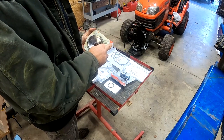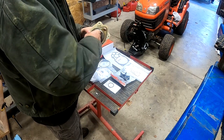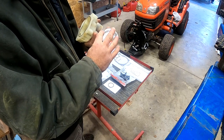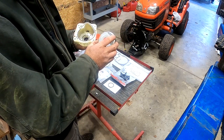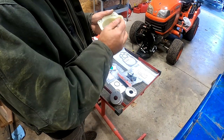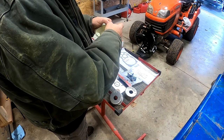I'm going to start disassembling this housing. It's going to be pretty tight in there because when they assemble it they use RTV sealing — they smear a little bit around this side. We'll save this so we know exactly where to put it on the next one. Here I'm using a dental pick to remove all the old O-rings. For this main O-ring, when you dig it out there's going to be some residue in the groove that you want to make sure you clean out really well, or else the new O-ring won't sit properly. Here I'm test fitting that O-ring to make sure I have that groove cleaned out nice.